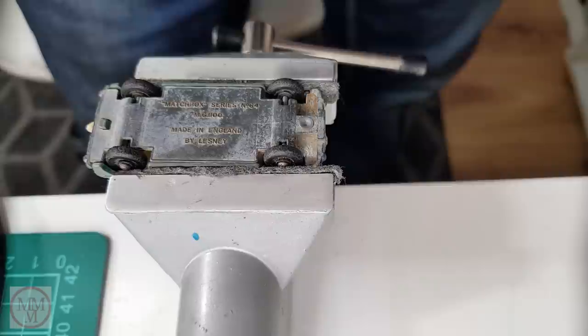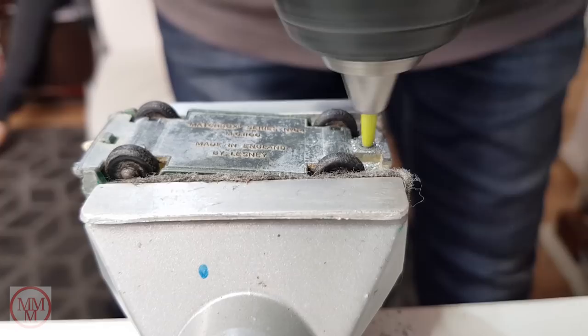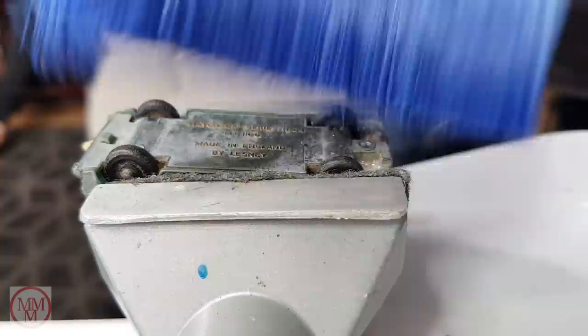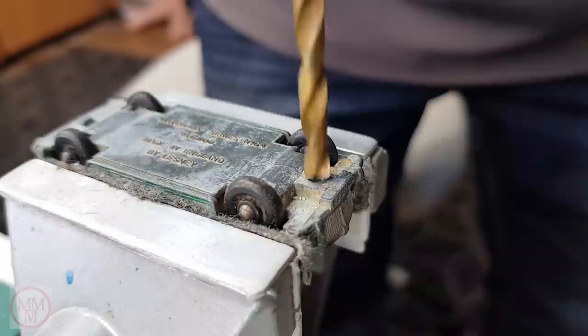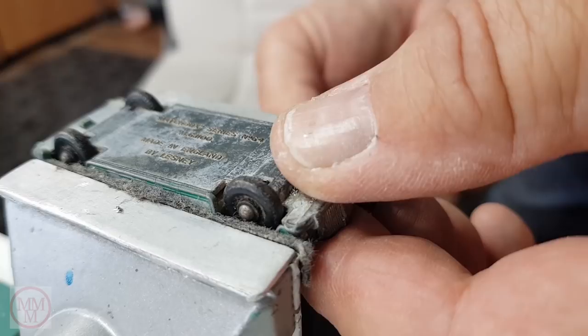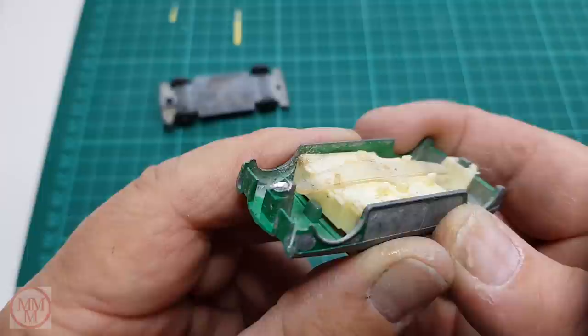First of all I put the model in the vise, then using my 1.5mm drill bit I drill out the rivet post — it's self-centralising. That bit of tape around the drill is to make sure I don't go too deep. After drilling the centre hole I remove the edge of the rivet using a slightly larger drill so I can remove the base. I lift the front out first, followed by the rear because the rear is held on by the tab.